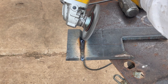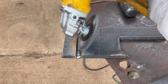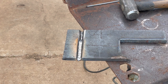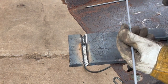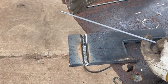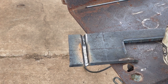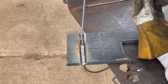That's reminding me of 70-plus. The way it was toenailing reminded me of 70-plus. That 70-plus is the 80-10 rod we weld with on pipeline work — a downhill rod we weld with a lot. It's just regular 80-10, not the pipeliner, not the 80-10 pipeliner. And for a while there, I don't know how it is now because it's been a while since I've been on a pipeline, but used to those 70-plus rods would toenail real bad.